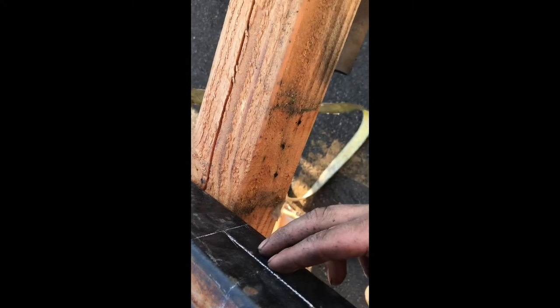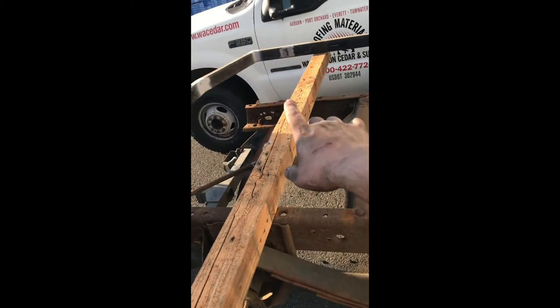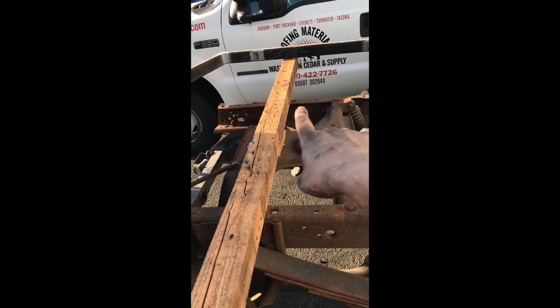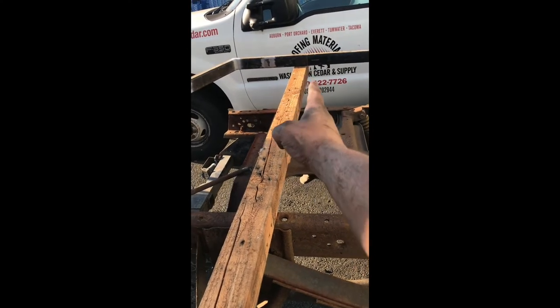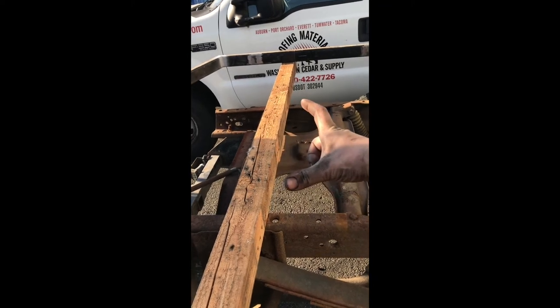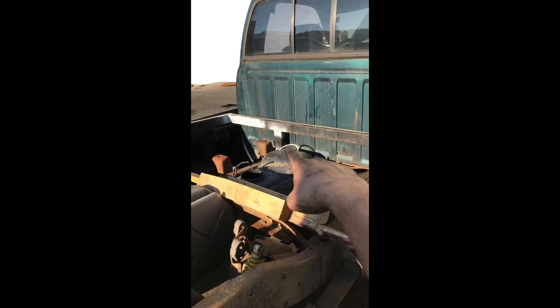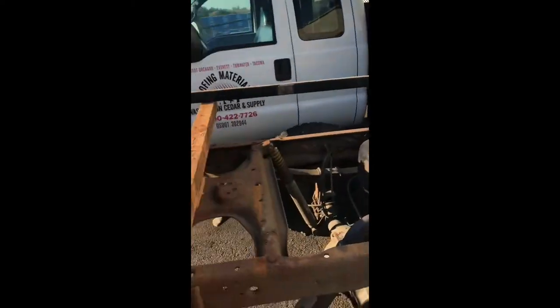That's where my cross member will connect, and it's a total from that line to the frame of 5 inches. So I'll have a solid cross member all the way across and 2 short standoffs underneath with a stud hanging out, just like I did those ones.